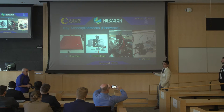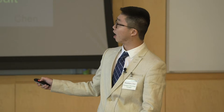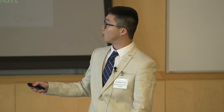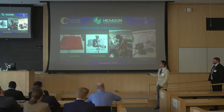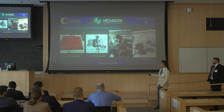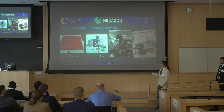How the print head works: the red heater element inserts into the heat block and raises its temperature. At the same time, a thermometer measures the heat block temperature and sends that data to the Arduino, which controls the power to the heater. When it reaches the target temperature, it turns off the power so the heat block stays at that temperature. When temperature is reached, filament comes from the top, goes through the gear in the middle, gets melted in the heat block, and is extruded out through the nozzle. A metal heat break and fan displace the heat so it doesn't damage the motor.